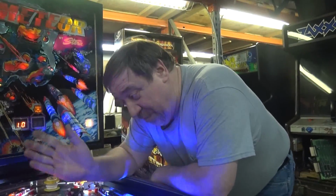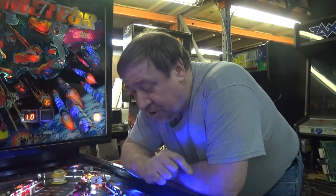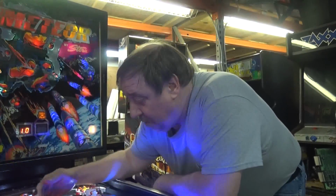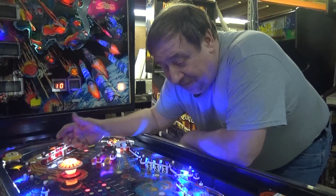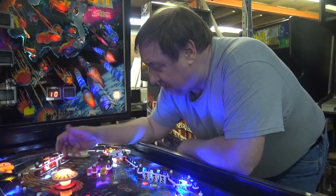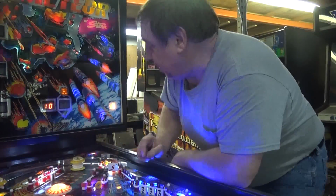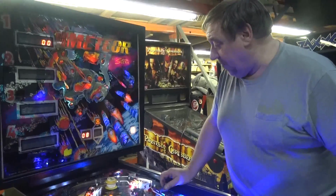But we've put in new targets, courtesy of Steve Young. He makes Stern targets, thank God. He also makes Stern plungers or links for the flippers, so the flippers have full power. Of course, we changed the cabinet switches, the end of stroke switches, the sleeves. All that's been changed too. And the game is in just terrific shape. I think we're ready for a start, Frank.